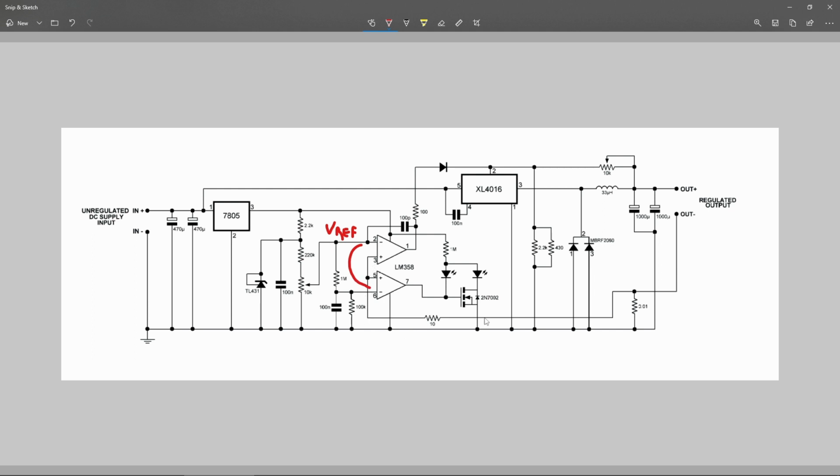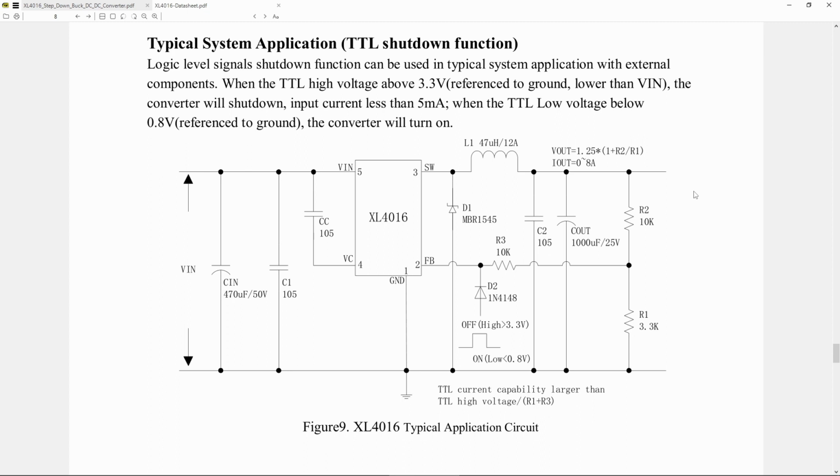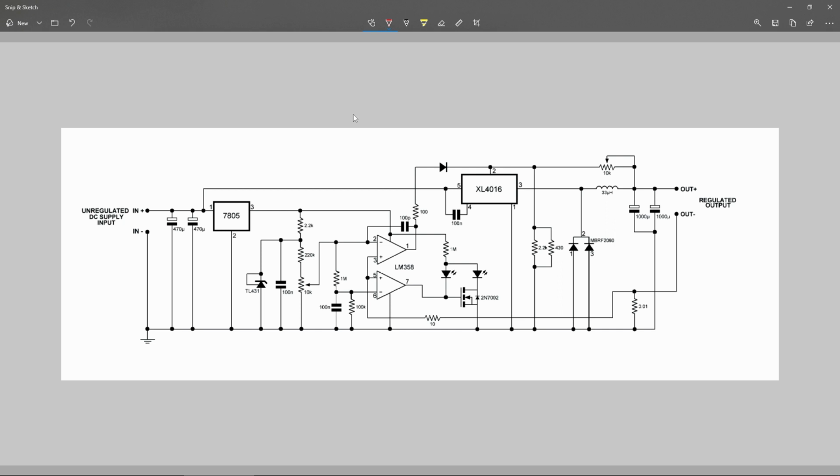And what are pins 3 and 5? Well, current sensing from the shunt. So this circuit here basically controls what I think is the set point for the current. And funnily enough, we have here the LEDs, and the LEDs go to the MOSFETs. I showed you this on the board previously. So this op-amp right here is just controlling the LEDs. The one important op-amp here is this guy controlling this voltage from these diodes, just as we saw in the example. So now we know that by controlling this voltage that goes to the diodes, we can control on and off this power regulator.